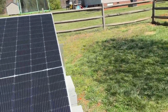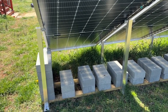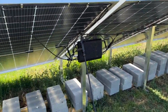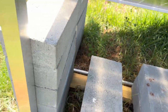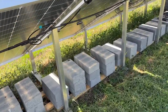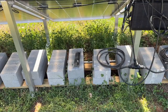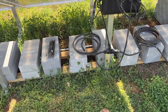I used ballast blocks to mount these bifacial 550 watt panels. When you do it with ballast blocks, you can lay out all the racks first — you thread through a piece of one inch EMT all the way down, space it out for your panels, bolt everything to the EMT, then mount your panels. Then you spend quite a few hours loading on ballast blocks. If you're going to use the other ballast mount kit, you lay the cloth across the frames using epoxy to glue it down, then load your gravel or dirt on there.